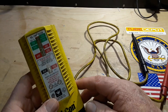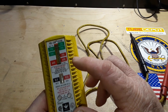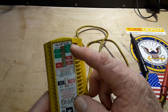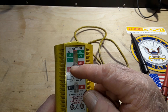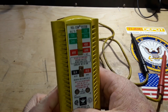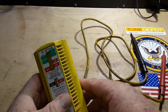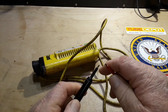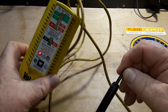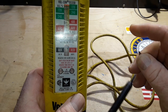These are great little devices. If you look up here, you can see it'll show us AC voltage from 120 volts clear up to 600 volts, DC from 120 to 600, and it'll actually show DC as low as 5 volts — it just won't register on the solenoid. It also has a built-in continuity tester. See that light? That means we've got continuity.